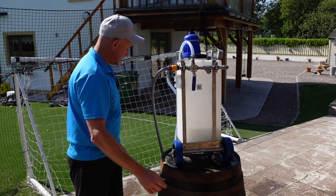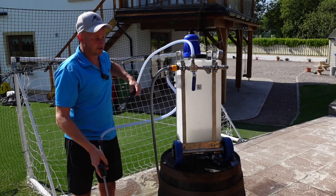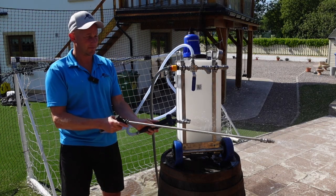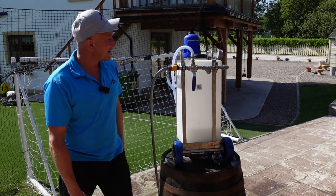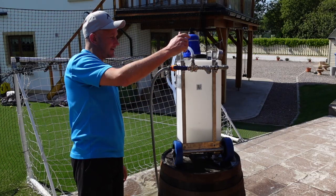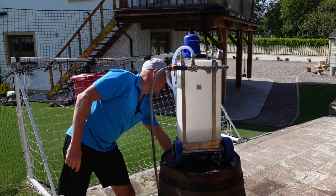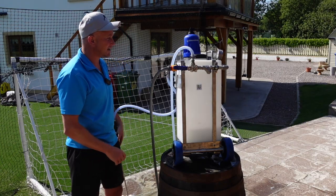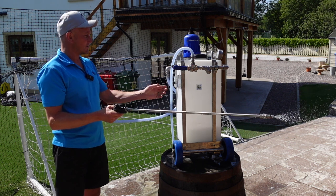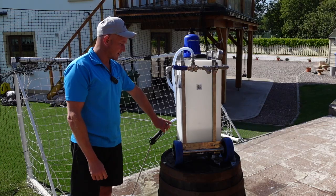In this position you can do both at once — double gun it. And then to finish off, just turn it to the off position and nothing will work. Always turn it off before you put it away and depressurize the Dosatron, because even when it's off, if it's still pressurized there's still product coming out. So always turn it off, depressurize everything, and away you go.